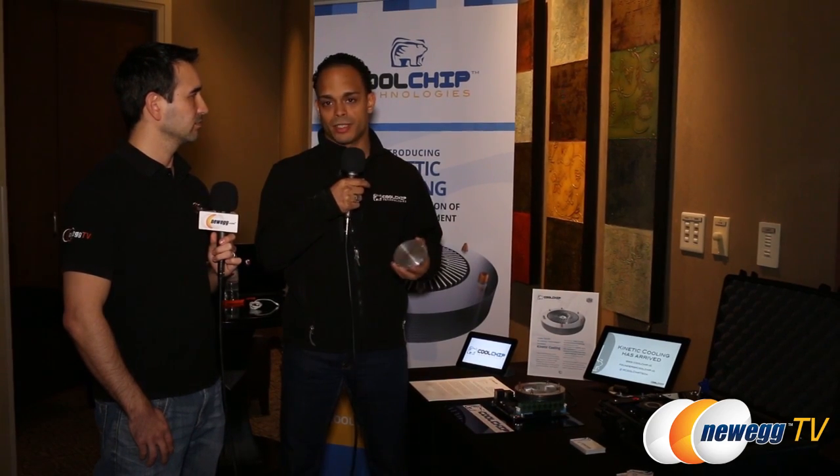You probably can't hear it unless I put the mic to it. Watch what happens when I turn on the commercial part. I can't hear you with the commercial part on — it's pretty loud. And at this RPM, we're actually removing more heat. So we're the same size, removing more heat, but significantly quieter. If you combine two parts into one and fix two parameters out of three — thermal, size, or acoustics — the other one skyrockets and outperforms the status quo. We can remove heat 40 to 50% more efficiently than the traditional solution.